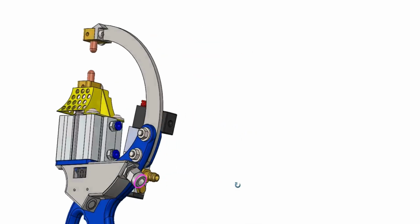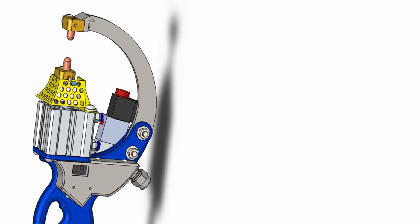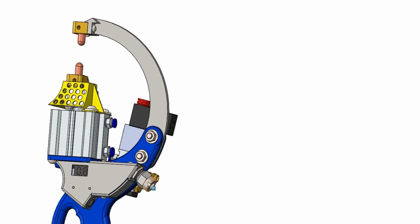So when the air is passed in, the piston is shot out. Then the signal is sent down here to the transformer enclosure through this SY cable. So 12 volts is passed from this clock cycle timer down to the enclosure, but the transformer does not start because there's an off delay that holds the transformer from starting for, I think, milliseconds, or maybe 500 milliseconds. I'm not sure. It's not very long anyway.